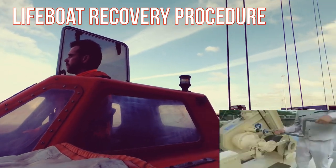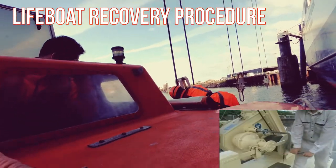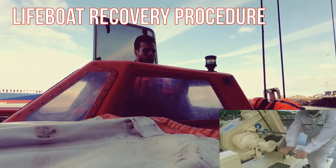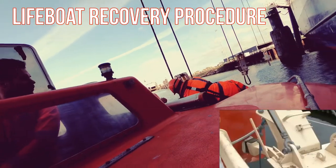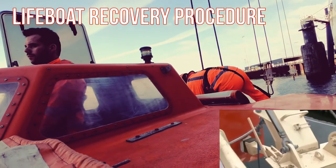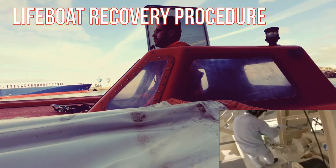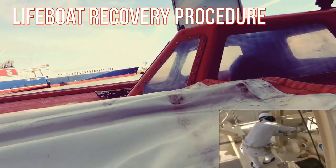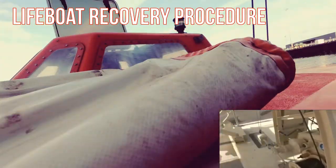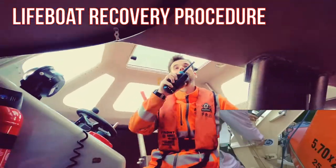When the winch stops automatically, manually hoist the davit arm. Confirm that the davit arm is in contact with the platform stop and cease winding. Beware of overwinding. Do not forget to detach the manual hoisting handle once winding has been completed. Immediately reset the davit arm stop and insert the safety pin in the davit arm stop handle.